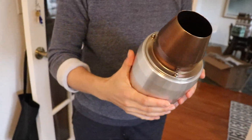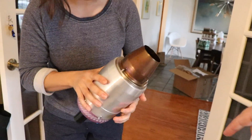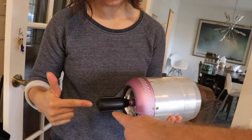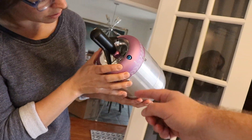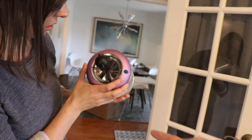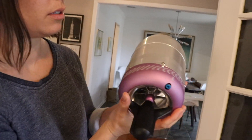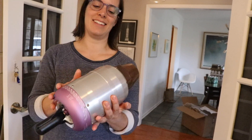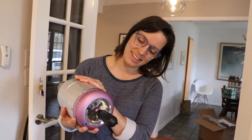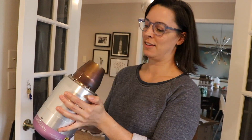How does it work? The black thing in the middle is an exhaust gas temperature port. This black part here is a really heavy-duty motor which will spin up to 40,000 RPM so it can start. The fuel goes in here — it has a fuel inlet right next to it. This will make 52 pounds of thrust. It's essentially 50 horsepower — you'd need to be at 186 miles per hour to convert that. So this is the only time I can look at it like this? Yes, otherwise it will melt your face off.